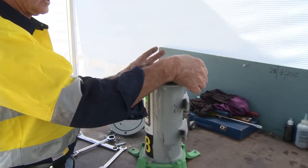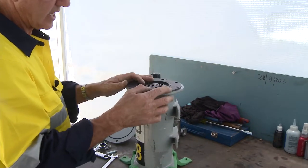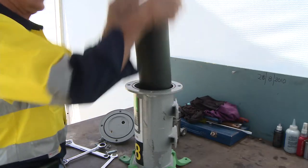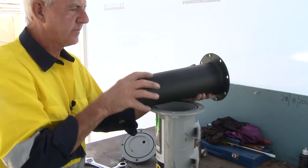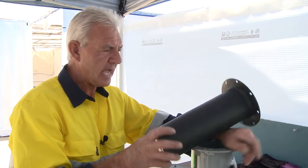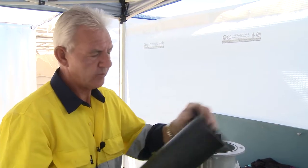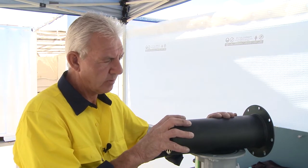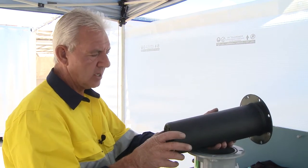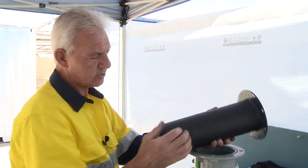The cartridge itself has a series of holes in the flange that line up with the four holes in the unit, irrespective of where you place it. The cartridge comes in a plastic bag — the filter won't work until you release it from the plastic bag and allow air to reach the ends of the filter. Try not to open the plastic bag until you need the unit, because it is sealed off and won't be contaminated by the environment while housed within the bag.